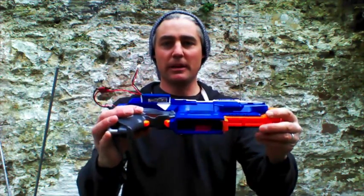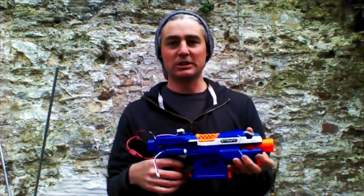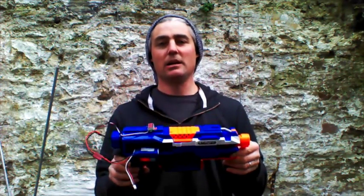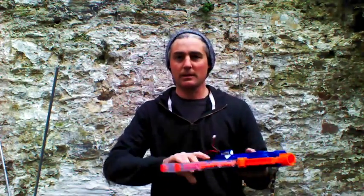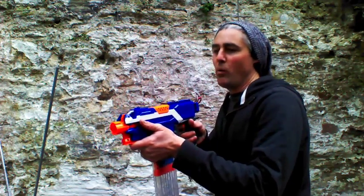Now for the LiPo test. I've wedged the LiPo in there temporarily with some sticky Bluetack-type stuff to hold it, just to show there's no trickery — no 3S pack hiding inside the tray. The LiPo is reading 8.35 volts at start, so the starting voltage is similar across all three. Freewheeling the motors, it reads 8.2 volts — a drop of only 0.1 volts, which is much less than the other packs. Under load during firing, it reads 8.1 volts.